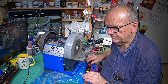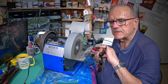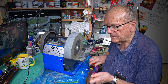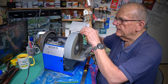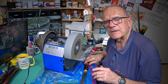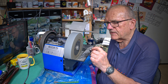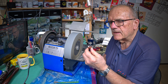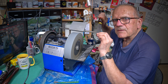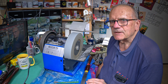The next step is quite time consuming, being as that I have got everything out of adjustment from the last time I actually sharpened these chisels. These three chisels that I'm going to sharpen are all on the exact same bevel, so if I get it right for the first one, I'll have it right for the other three. I have to get this adjusted just right. This is not a tutorial on how to adjust this machine — there's plenty of those on the Tormek, plenty of those on the internet already. What I do is I will mark with a felt marker little lines along the edge here, and then I can tell whether I got to go more this way or more that way as to how the lines wear off. It's time consuming and you don't want to watch.